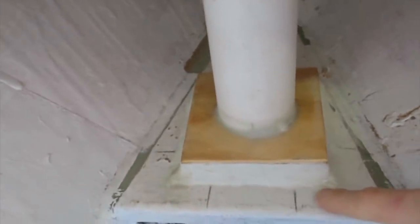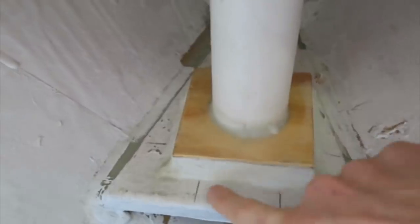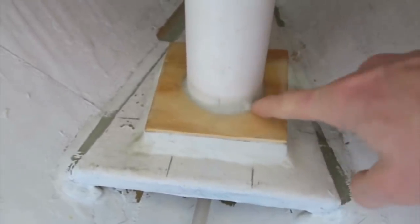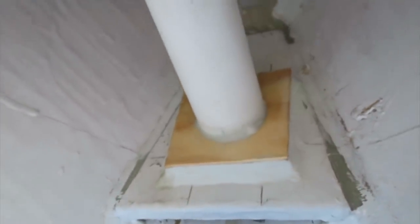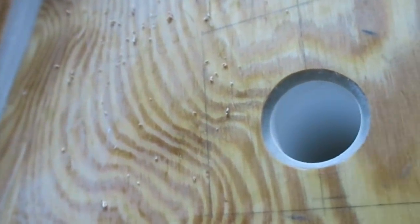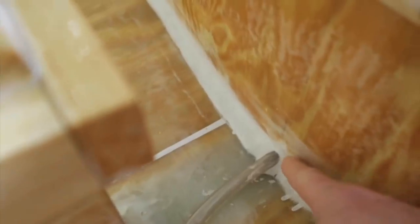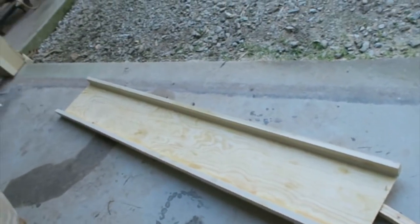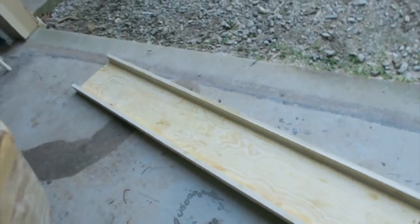There is the final product of the mast step and the retainer collar. I put a nice big thick reinforced fiberglass fillet around this thing, and then filled in the crack with more fiberglass and epoxy, so that thing looks pretty darn solid. I'm going to work on this fillet a little bit more just to get it nice and smooth and make a nice curve down into the pipe from this surface. The epoxy has set up on the little drain pipe, so I just need to trim where the pipe exits the locker area, and then that project will be done. Finally, I think I'm going to be working on the bench seat here for the aft section of the boat.